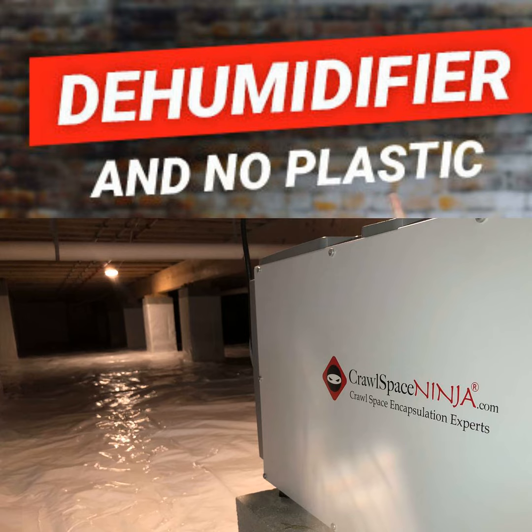What that means is: up the walls at least 12 inches, mechanically attached, overlapped and taped, and all that sort of thing. We've got a lot of videos about properly installing vapor barrier. What that is going to do is get you within code. Remember, if you install a dehumidifier and seal the vents, the code requirement is different than if you leave your vents open, when it comes to the plastic installed in the crawl space.